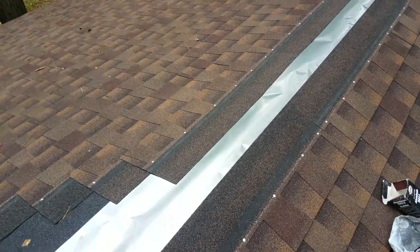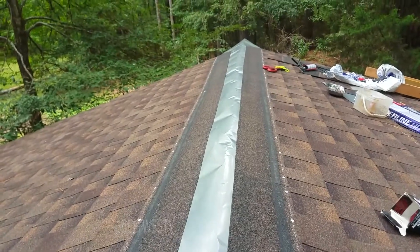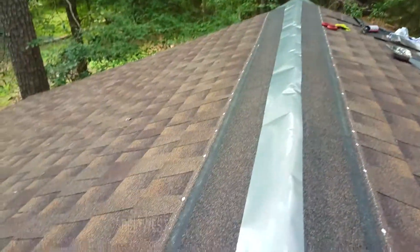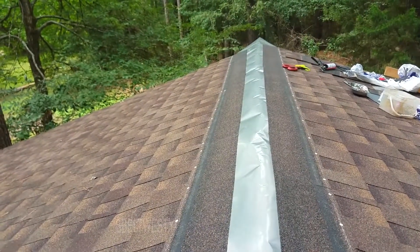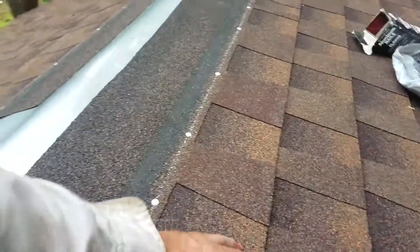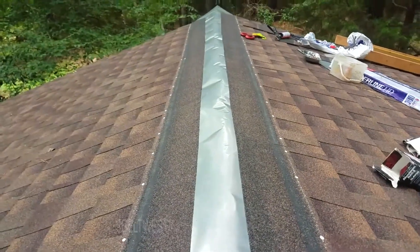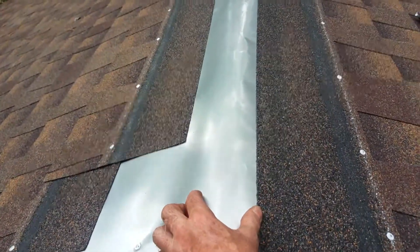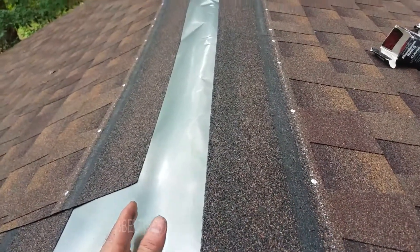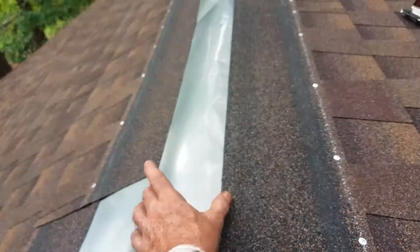Going to put a ridge vent in there. On this side, the right side, I never did snap a chalk line, so this comes fairly close to the ridge without any alignment. On the other side I snapped a chalk line about 40 to 50 percent of the way up, but lining up to the bottom edge after a while you can get out of phase. This one's got about 14 feet down and it's fairly true — true enough. Going to cut a gap in here later for the ridge vent, which is about a foot wide.